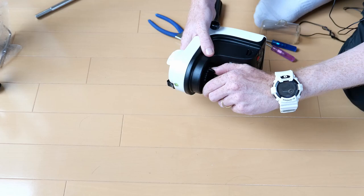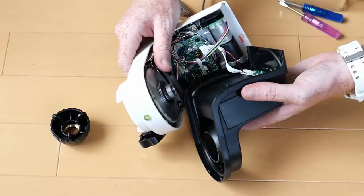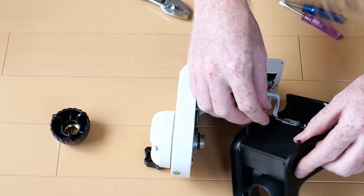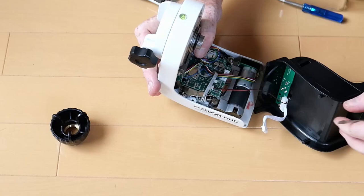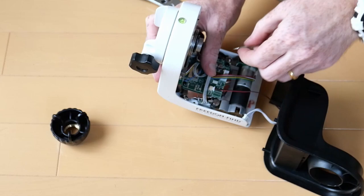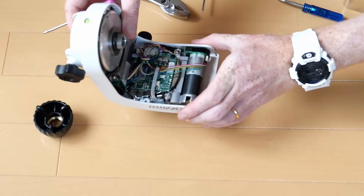Once we've done the six screws — the two at the center seem to be pointy screws while the others are flat-ended, so there's a small difference, though they're all exceedingly low quality — keep them in order. Next, you want to remove the declination axis clutch and then remove the cover. The cover itself is attached via some electrical wires which you can pull out, but you have to do it nicely — it can be a bit stressful.